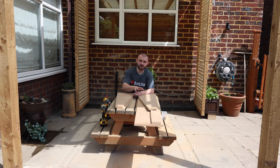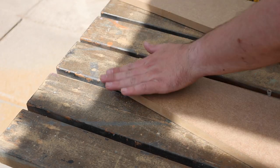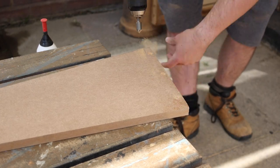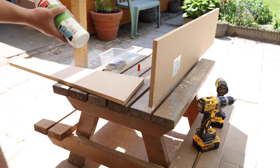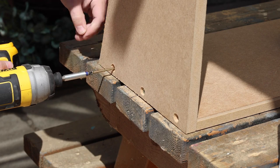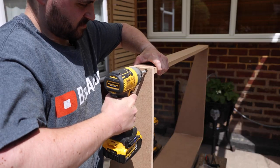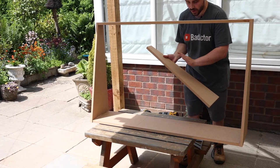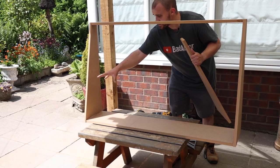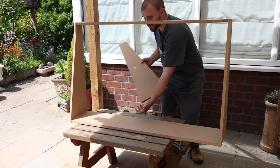With those pieces cut we can start on the construction. For now I'm going to put to one side the base, the top strip and the smaller triangle, because first I'm going to pre-drill some holes into the two side triangles. With the sides pre-drilled I can now get them attached with some glue and screws. Now that the side triangles are attached to the bottom piece I can get the top thin strip attached with some more wood glue and a couple of screws. With the basic frame constructed I can add the smaller middle triangle piece. I've measured a gap of 40 centimetres for the cubby hole, but you can make this measurement whatever suits your needs. This gets attached in the same way with wood glue and screws in from the bottom and from the top.